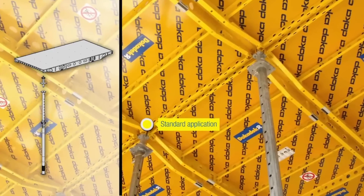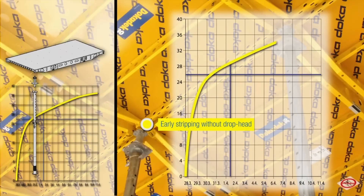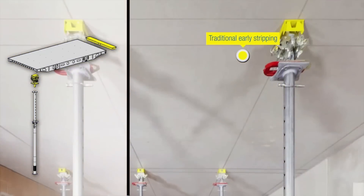One of the safety features is that the large panel, which sits on two galvanized steel props, has an anti-dropout device built in so the panel cannot drop down on its own. It has to be lifted up and then moved away from the props, which ensures there's no danger of something falling on anyone.